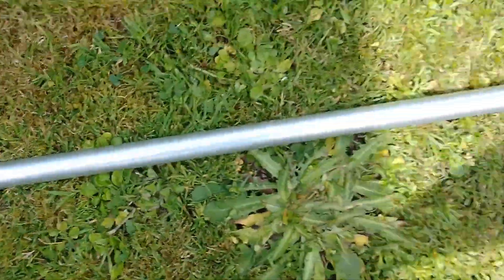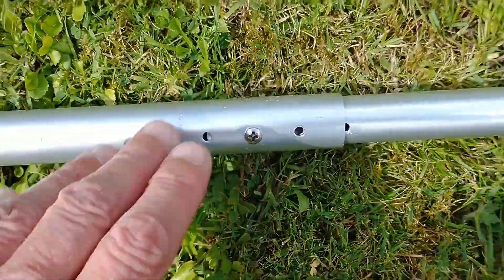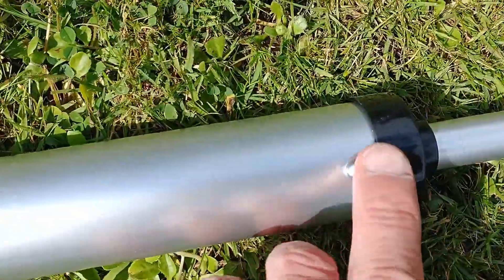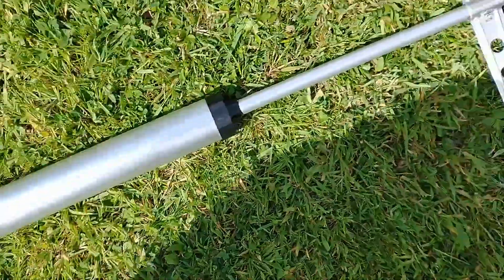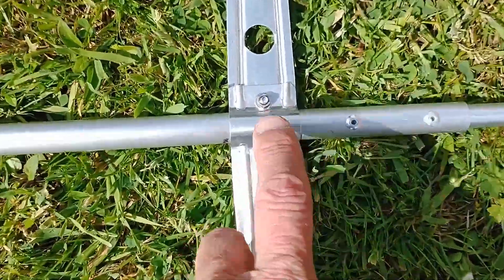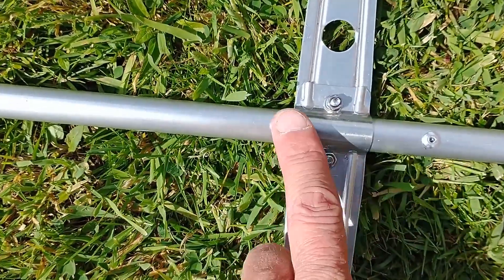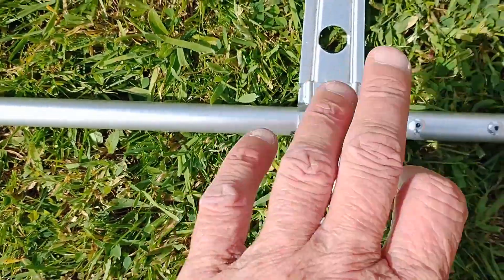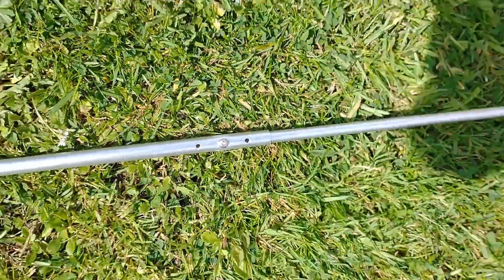Three rivets hold that together. And then you have an adjustment point for various SWR adjustments. Tighten these on the top sides - you'll be able to get a good half turn onto those. More adjustment points. Now these little winglets - you're tightening these together. No matter how tight those screws are this floats about, so I had to put a little shim of insulating tape behind it, clamp it down. And they're set measurements to the distance. For 40 meters you can adjust this as well to get a proper SWR.